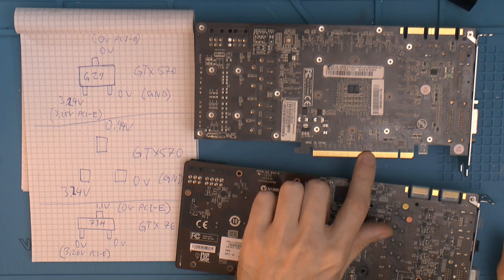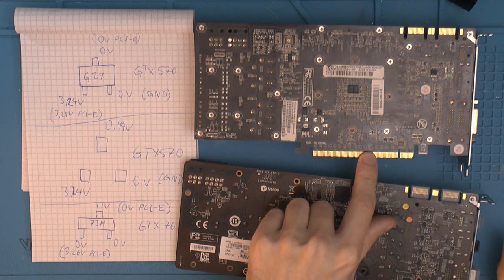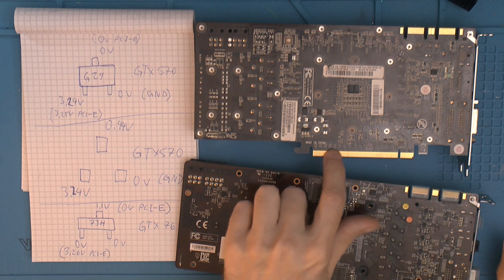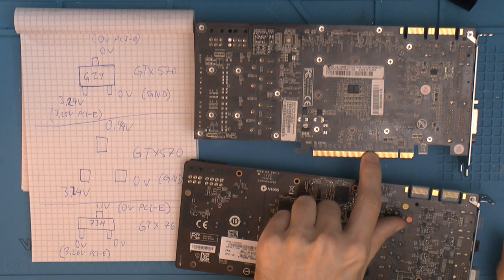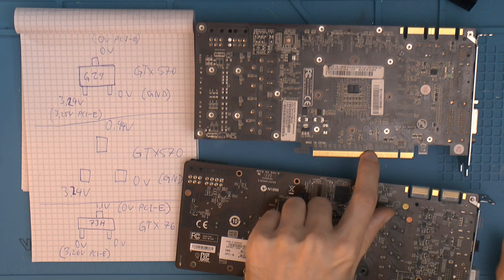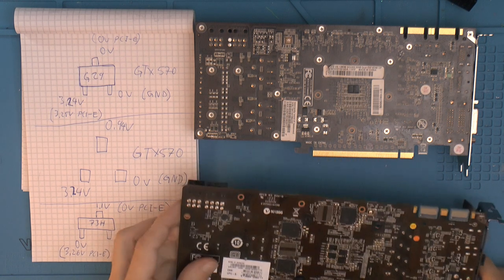I figured out that the board I wanted to use was PCIe Gen 1. The boards I was testing on initially were PCIe Gen 2. I also tried Gen 3, and that also works. So I suspect these are for the same purpose. They have something to do with PCIe generation negotiation. I'm using a Gen 2 board right now, so the card does post, even if it artifacts after a while. But if I want to use this in a Generation 1 board, I do need to put that SMD cap back down here. There's one missing, I don't think it's there anymore.